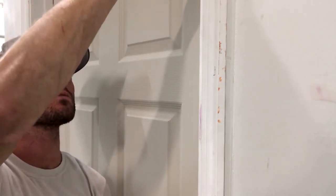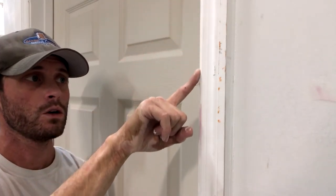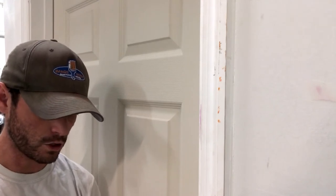If you like these kind of videos, please subscribe and we'll keep doing them. While your caulking is still wet, just drag your finger down it — it helps if your finger is wet, and you're pressing the caulk into that crack as well as giving it a nice uniform look all the way down. If you're not very comfortable with caulking, you can run blue tape down the edge and that will give you a nice clean line on both sides of the caulk. We're going to come back when all of our prep work is dry so we can sand these spots down, and then we'll be ready to reprime those spots and paint the walls.